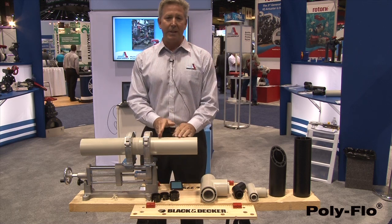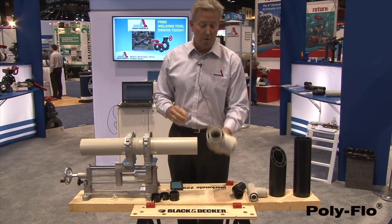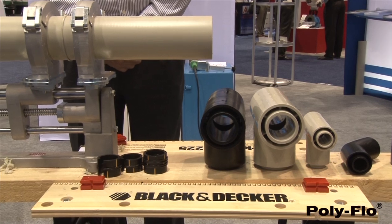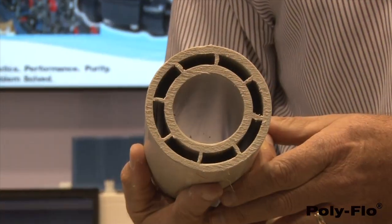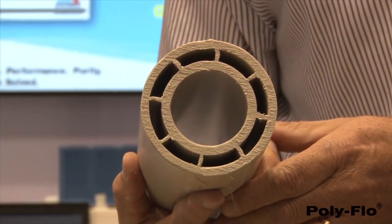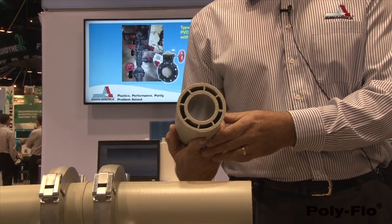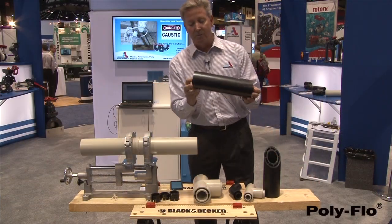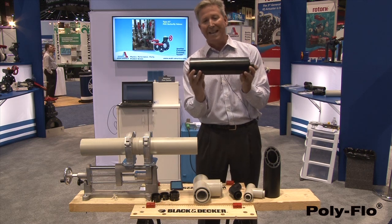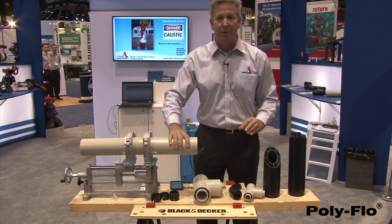The pipe comes in 16-foot, four-inch lengths or five meters. The fittings are all injection molded — tees, 45s. We also fabricate fittings as well. These eight centralizers right here unitize the system. It locks the carrier pipe inside the containment pipe. By that I mean, we don't have any differential expansion and contraction. If you take the carrier pipe system that we fabricate, this is a loose system, so this carrier pipe is going to move independent from the containment pipe. We don't have that with this particular system.